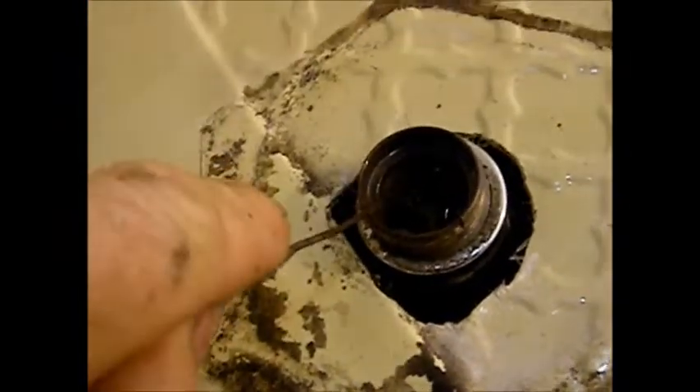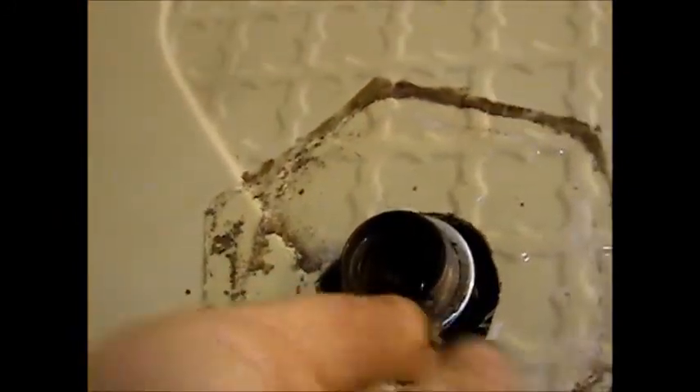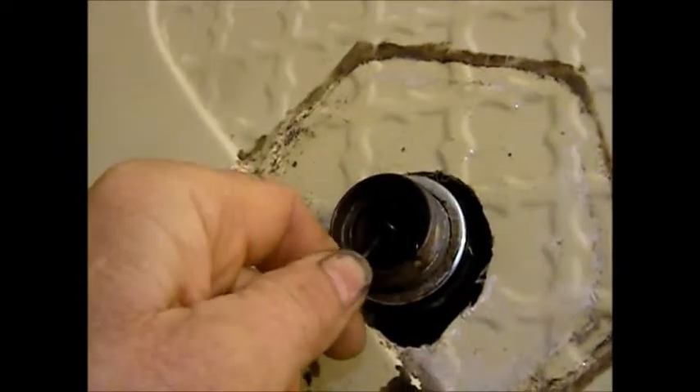You should use a little bit of waterproof grease in there. I made this little puller tool - just take a little coat hanger and put a little hook on it, go in there, grab onto it gently and it comes out. Then we're gonna put a new spring and a new washer in.